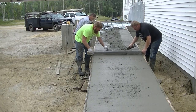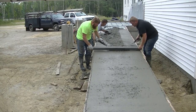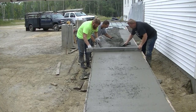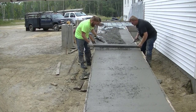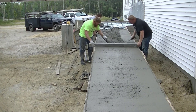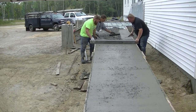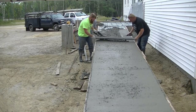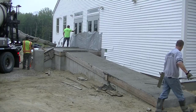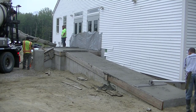What makes it easy is they can both screed it from the outside using the top of the forms that I got set right to grade. We're just going to keep filling under the straight edge until we get it all screeded all the way to the top of the landing up there. We don't want a bunch of waves — dips and humps — so that's why we kept the concrete pretty dry.